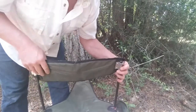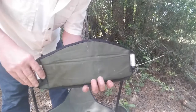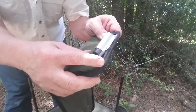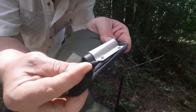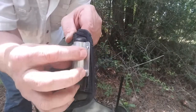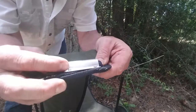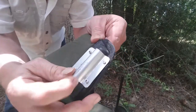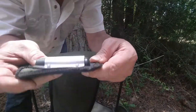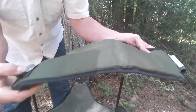It had some rivets that came out and it ripped because I like leaning back in the chair a little bit. These plastic pieces ripped out almost immediately after I got them. What I did was take some sheet metal — I think it's about 30 to 45 thousandths — made some pieces that wrapped around the shape of this, put rivets through it, and now it works very well.